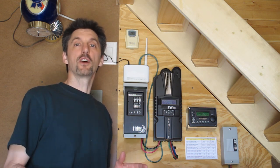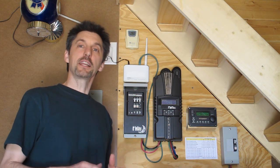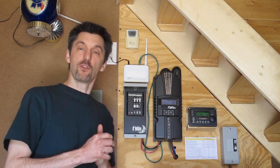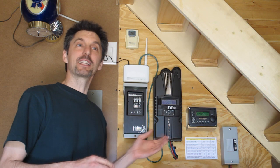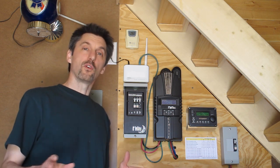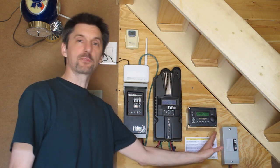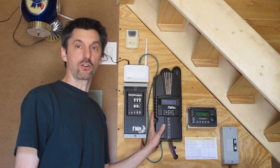For those who didn't see one of the first two videos, the charge controller works in three stages. The first stage is bulk — when your batteries are less than 80% full, it tries to put in as much amperage as it can. Once they get to about 80% full, the batteries start to push back. So it raises the voltage and lowers the amperage to get those last bits of power in. Then, once they are full, it goes into a float stage, which trickle charges the batteries because even when you're not using them, they lose power. Our charge controller then hooks up to a circuit breaker box so we can isolate the charge controller should we need to work on it.